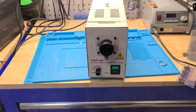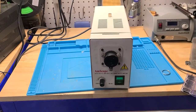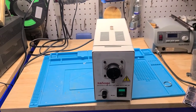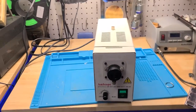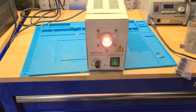A friend of mine was using this to illuminate a piece of work on a lathe and a sliver of metal got in there and destroyed it. I replaced the C3306 transistor, jumpered out the track on the board that was burnt out, replaced the fuse and the bulb, and it works. So it will be on its way back to you, Chauncey. Everybody have a good day.